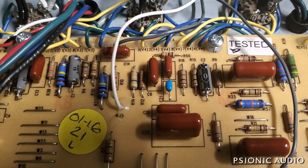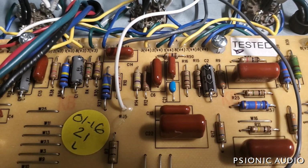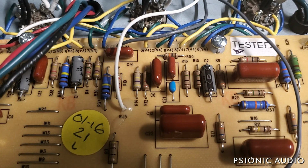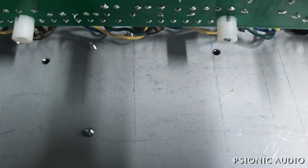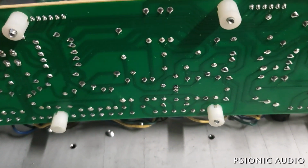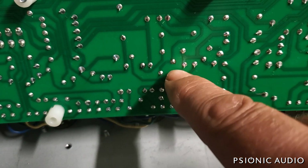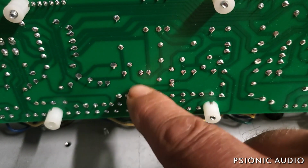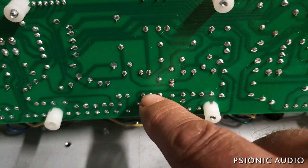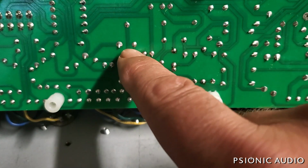So in most Fenders, that's towards the tube sockets. Now I've got some other resistors and capacitors to remove from this, and I'm not going to do a blow by blow, but I will show the board with everything removed that's getting changed out, and then things will magically reappear. And the important thing throughout, and I'm not going to show it on every one because, again, the video does not need to be very long. But here is that new resistor with its leads bent over first, and here's that new capacitor. And aside from my solder being slightly shinier than the factory, it looks factory. There's still a little bit of flux there.